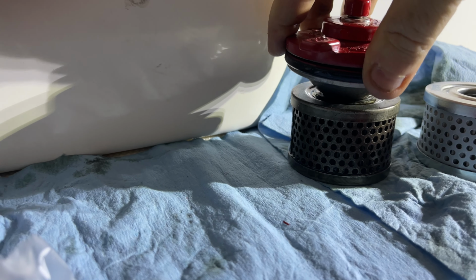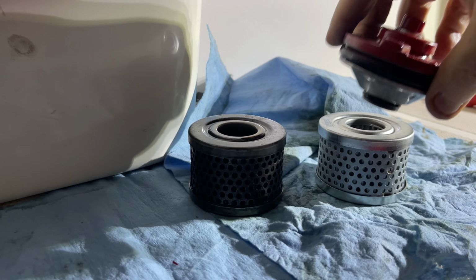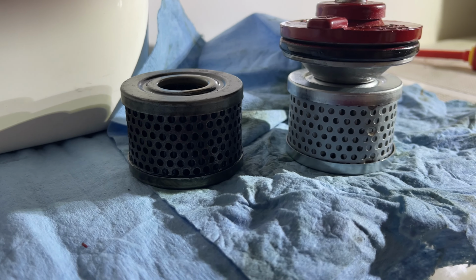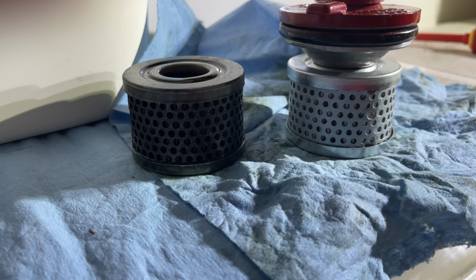Now that is obviously the top, so I got lucky there. What you'll see is if that were the bottom, if I were to install it that way and try to seal it, that would not seat, and you would never be able to seal that cap. So that is definitely the top, because you will see, once again, that it seats in there just like that. So when you reinstall it, that's the orientation that you're going to want. Okay, so let's get at changing those two O-rings.